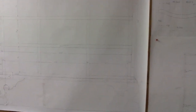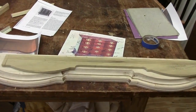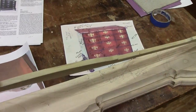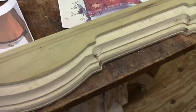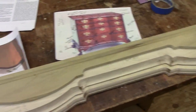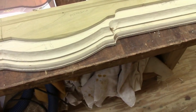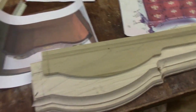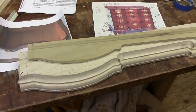We have the side view here and the front view over here. I'm going to make it out of mahogany — both mahogany and pine. I spent some time making templates from the drawings. This is a drawer divider or drawer front, because the drawer fronts match the drawer divider. This is the bottom molding that goes along the side — Doug helped design the bottom molding, as I didn't like what was on the original piece. And this is the straight molding piece here.